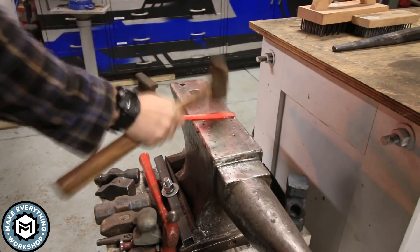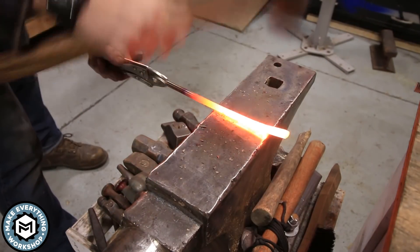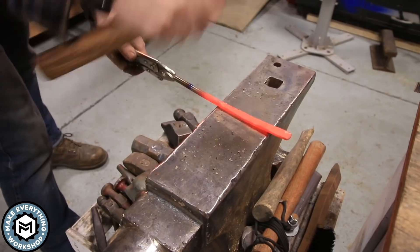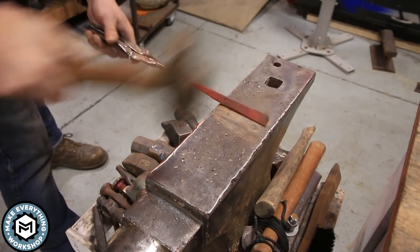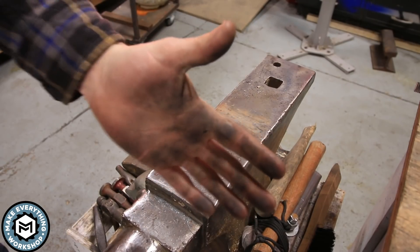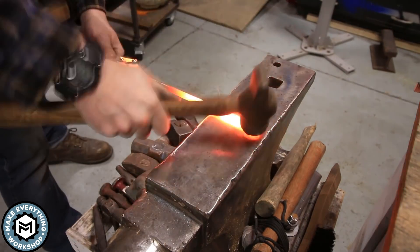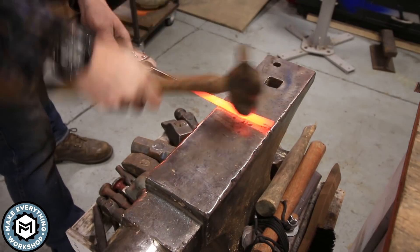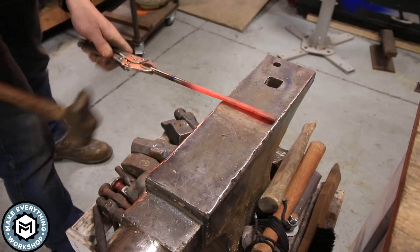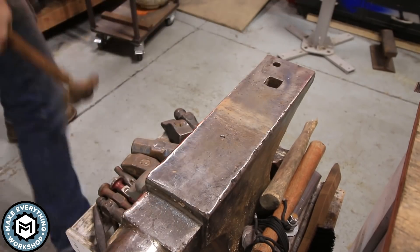What I found was that the titanium was getting really hot very quickly but cooling down almost as quickly. It was really absorbing the heat but then also losing it — shedding it pretty easily. It was pretty easy to work though, not totally difficult. It definitely was a little different than the little bit of experience I have hammering steel.